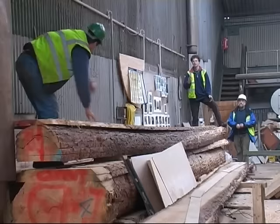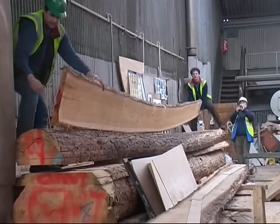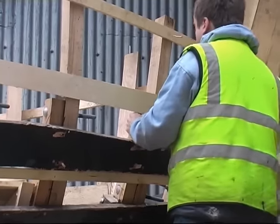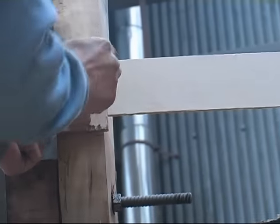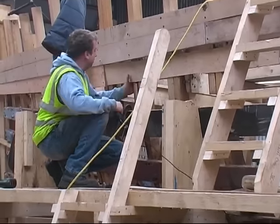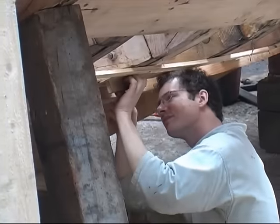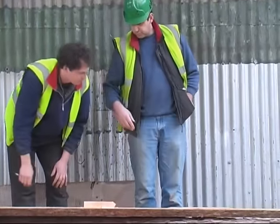The rest of the planking is of larch. This was grown in Scotland. Plywood templates are made for each plank. They are measured to match exactly the width of each plank replaced. The templates are positioned on the selected boards and marked up.